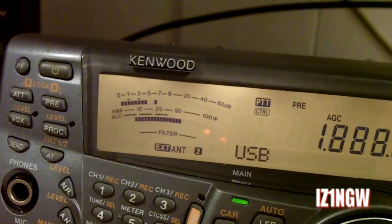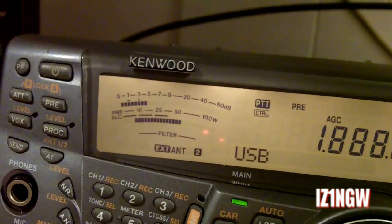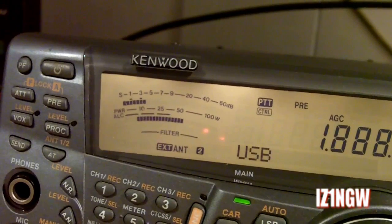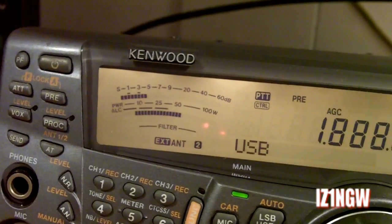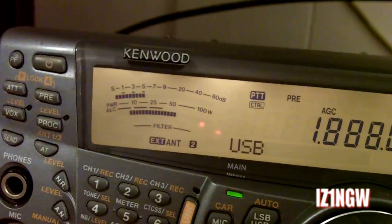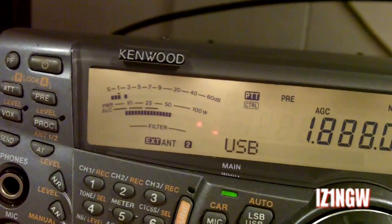Change the direction. Now 6, 7, 6, 7. The signal has changed from 3 to 7 — it's about 25 dB of front-to-back. 25 dB.